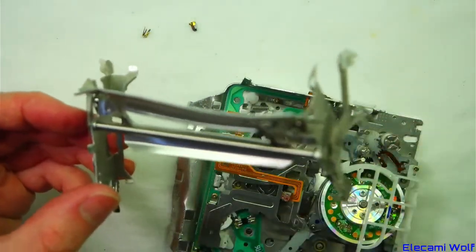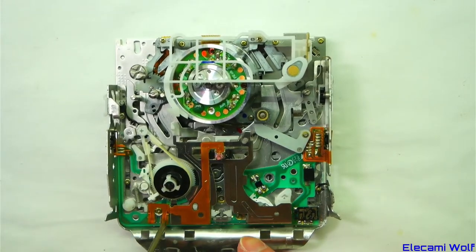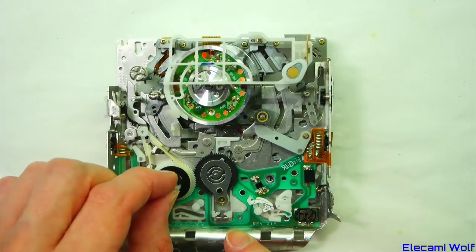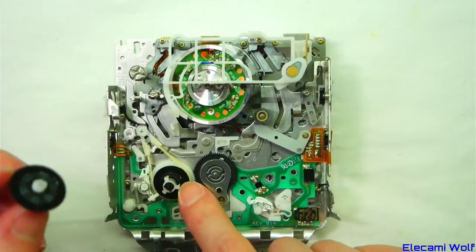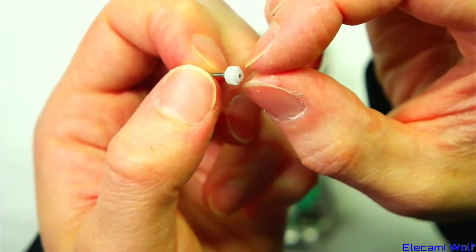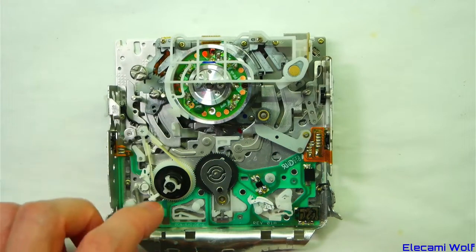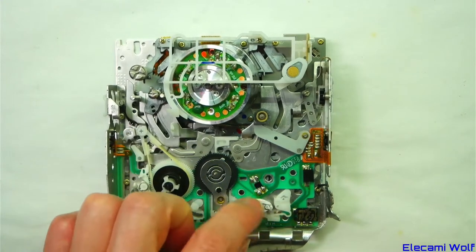That piece would need to be severely straightened out. I notice the top part here should be removable — it looks like it's got pressing contacts for the little infrared light for tape end sensing. The feed reel is snapped off — the supply reel. The take-up is supposed to be in that hole, so this little shaft thing has been ripped out of that hole there. It might have a plastic retaining mechanism — probably part of a braking mechanism there.